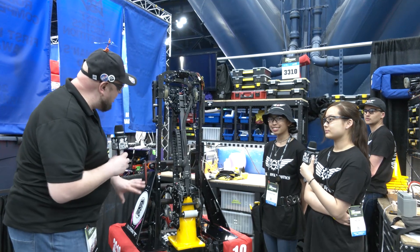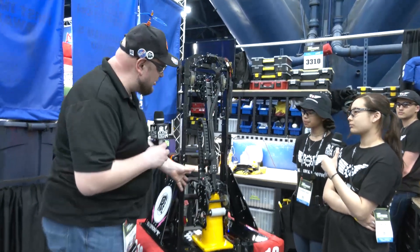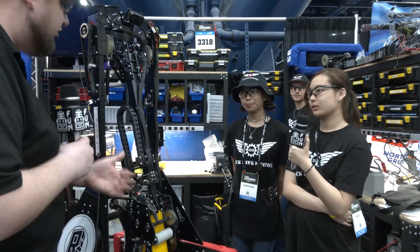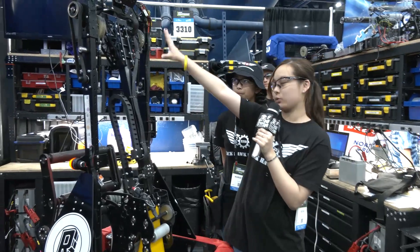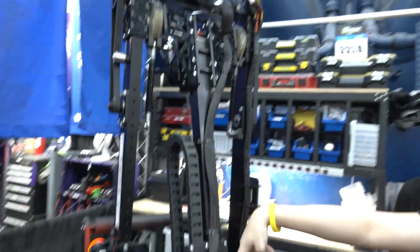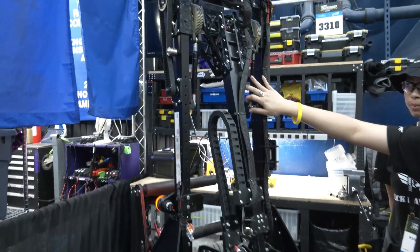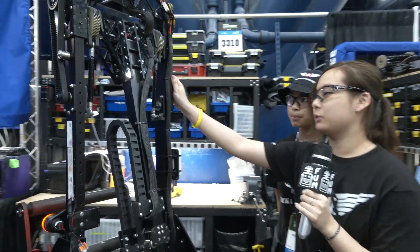Let's start talking about your arm here. You've got an awesome overall structure for it, going into your gripper as well. Give me a full breakdown of what it is and any changes going into championships. So our arm is a single-joint extend arm. We can start up here with what we call the hat. It is a jackshaft that is powered by a constant force spring down here. It's actually inspired by our last year's climber. We have gas shocks here to help balance it out, keep it even during the match. It's powered entirely by pulleys.